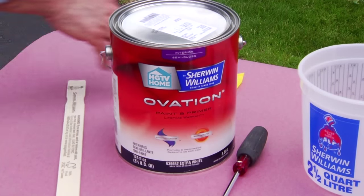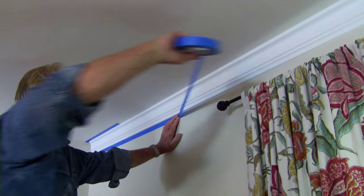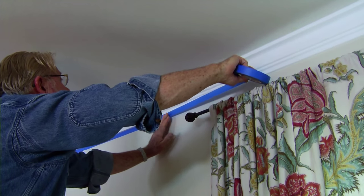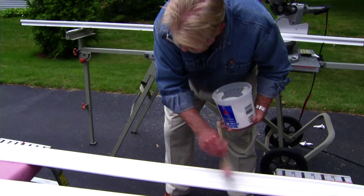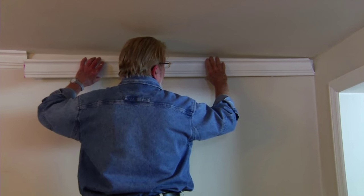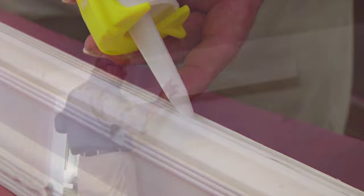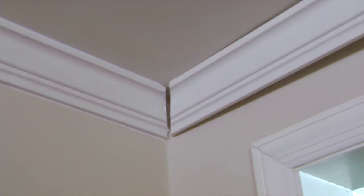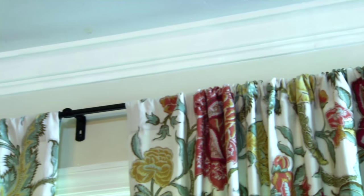Because the molding is bright white and the surface is perfectly smooth, one coat of high-quality water-based paint is usually all that's required. Applying masking tape to the wall and ceiling allows the molding to be painted in place without any mess. However, I think painting the molding before installation is easier and quicker. Once you get familiar with the process, the project moves along surprisingly fast — there's no noise, mess, or frustration.